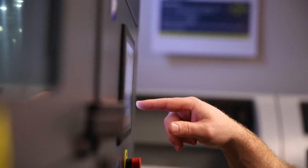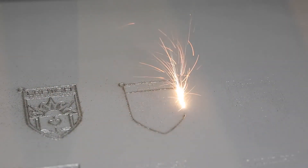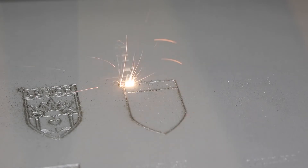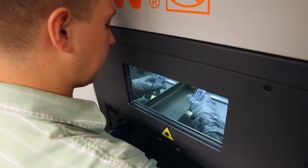There's both science in it and there's art in it. The science part is, you're taking this material that's extremely fine — you have to worry about it flowing properly into the machine, about how much heat you're putting in and taking out, what type of surface finishes you're going to get. But then it also comes down to how you're designing the parts. We traditionally think about designing our parts for more traditional machining, but when you come over here, all of a sudden a lot of those things can actually work against you.